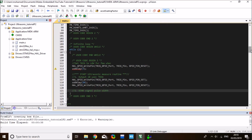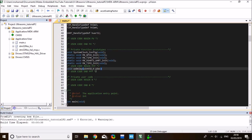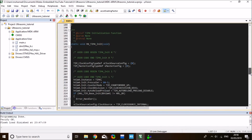It would have been much more convenient if I just generated over the same project, but I want to keep the main project so that I can link both source files down in the description of the video. So that's the function definition of the microsecond delay. I also need to prototype it at the beginning in the private function prototype section, and I need to define the microsecond delay here. That will be define microsecond TIM is on TIM4. Okay, now all the errors should be gone. So we added the microsecond delay, and we've added the 10 microsecond pulse on the trigger pin.